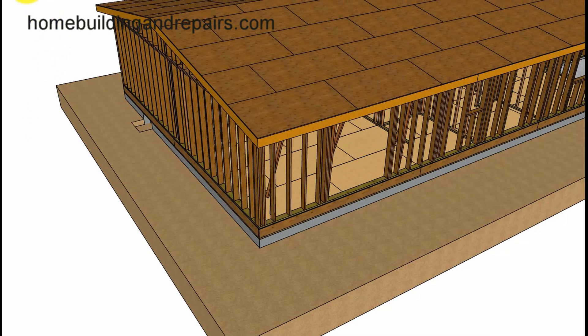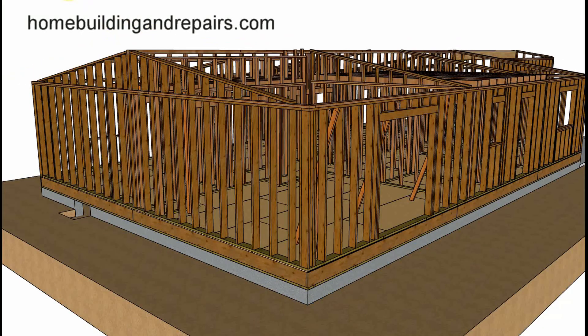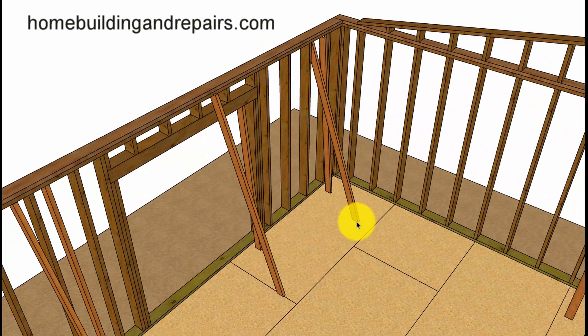In this video I will provide you with a few ideas on how you can support the loads so that repairs can be made below them to the framing base plates, framing components, and in some cases even the floor framing. Less of an angle is always going to be better than more of an angle. I do not recommend going more than 10 degrees for something like this. I'm not a structural engineer, so these are just ideas — they're not going to work on every project.